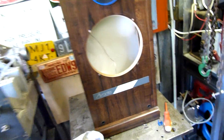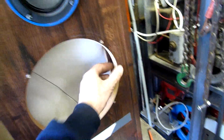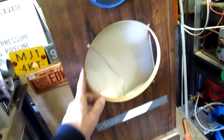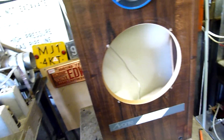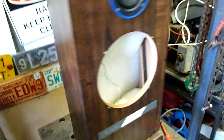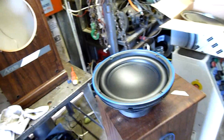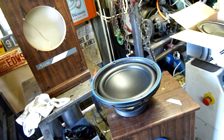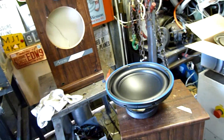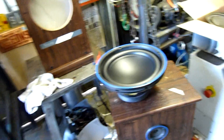It's a good cabinet though, it's MDF — particle board. It's not the most solid of things to screw into but given the extra screws that I've got, it should hold. Might even put a few little pads of silicon on there just in case. We'll find the weaknesses in this design with some bigger drivers. They'll be a stout punchy little system. The bigger the cabinet I find, the deeper or dronier they get. But you keep the cabinet really small and unported and you get some real nice punch to it.